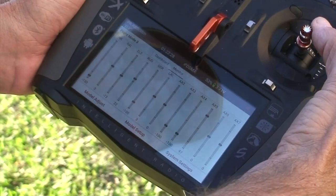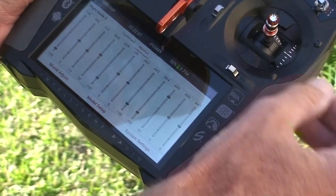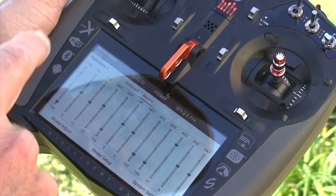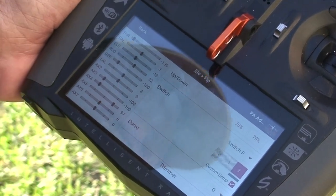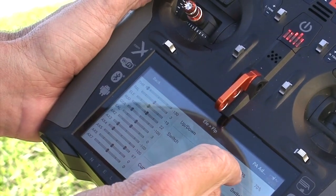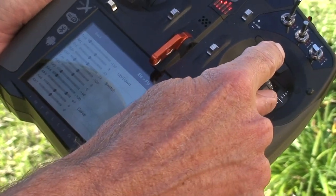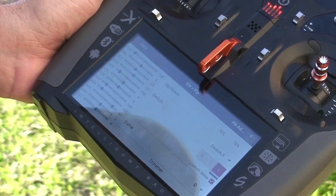This is the monitor section of my radio. When I deflect the elevator only, only the elevator goes. When I click this switch — elevator mix on all the way down — you'll watch and see both the right aileron and the left aileron move. Although it shows in opposite directions on the monitor, technically they're both moving in the same direction because of the mix. This mix is the elevator flap mix. The reason both move from the elevator flap is because when I set the model up, it was set for flapperons. So I set a 70% mix on the upside and downside of the elevator with the switch set to on. Now every time I deflect the elevator, the right and left ailerons will move up or down 70%, and you can set that to whatever you're comfortable with.